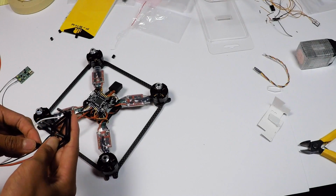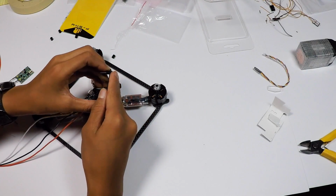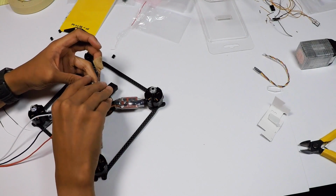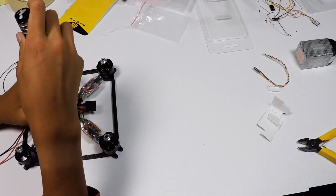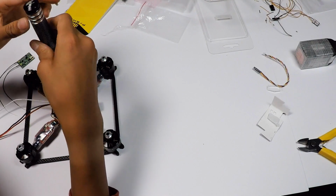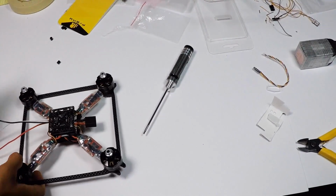Now this is going to be quite challenging, but you have to lower these guys in without having the spacers fall out and die. Alright, so I got all the spacers out already. What a success. So now you can screw these guys all the way in. So you can use your screwdriver. As you can see, I'm not using Loctite again because nylon will do no good with Loctite. Ta-da, this is how it will look like, the finished product, but we need to have the receiver on.